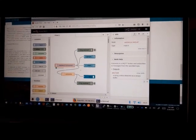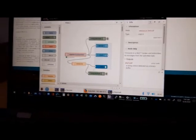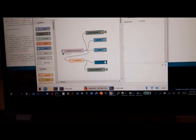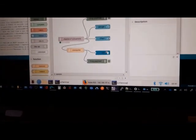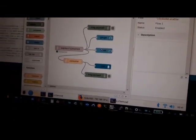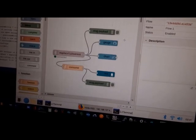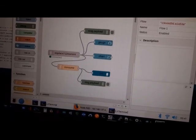If the consumption of the power line is so high, you can see this LED. This tree is the user interface for Node-RED, and I have a gauge, a chart and an LED. This LED is for the alarm notification, and this chart and this gauge are for online data showing our measurements. For the interface of this project, we should add UI at the end of this address.